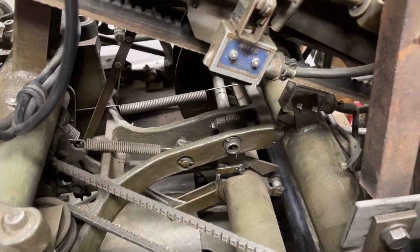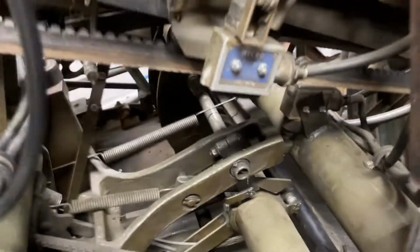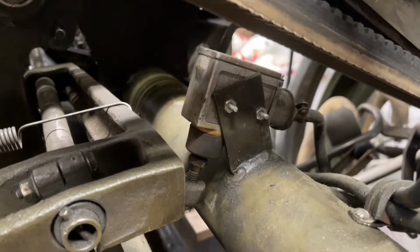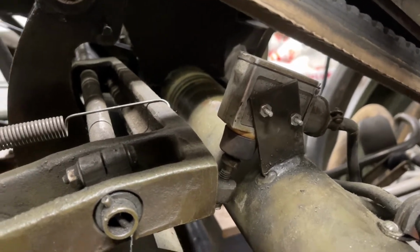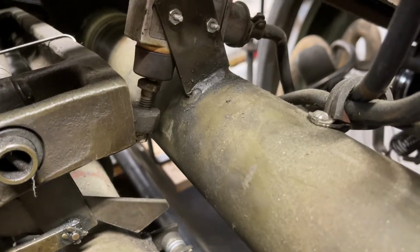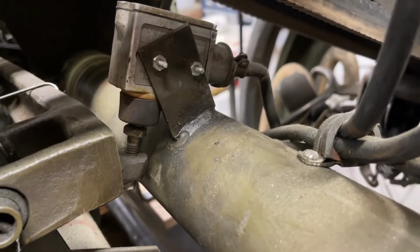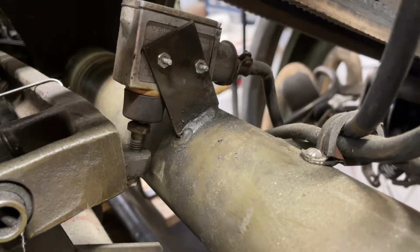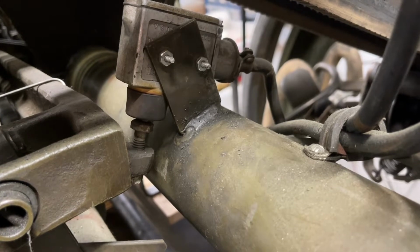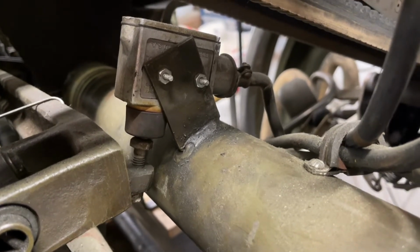All right, under your cross conveyor here, look very closely, you have that little switch right there. That is your turret jam blackout switch. If anything binds in the turret pivots up here, when it raises up there and lowers back here, you see a little bolt on there pushing that switch. If you have a bunch of pins on top of the deck and they lift up on the turret, it's going to lower that down, turn off the machine, and keep you from snapping a turret. So you want to make sure that's working.